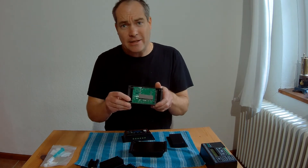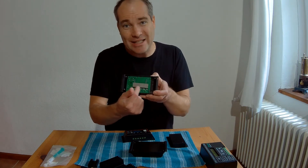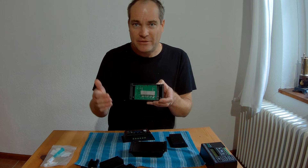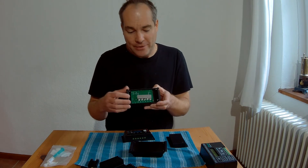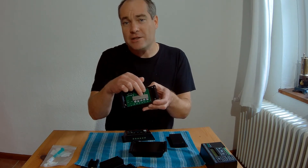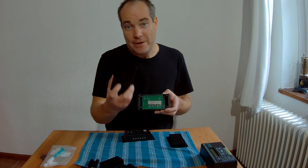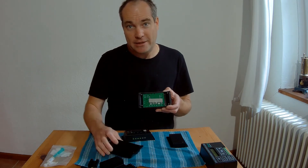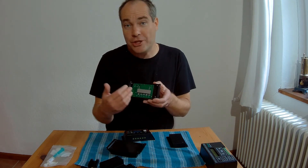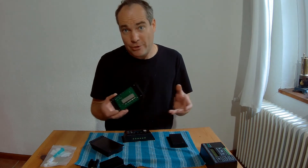Let's take a look inside. Inside these charge controllers you see a lot of MOSFETs. This is a 30 amp version and therefore has six MOSFETs. These MOSFETs are exactly the problem — not the MOSFETs themselves, but the way they are cooled. Quite often they are directly fitted on the PCB with heat tape over them, and that heat tape quite often no longer touches the metal panel at the back side of the charge controller, so the heat has no chance to escape the chassis. This causes the controller to burn quite quickly.